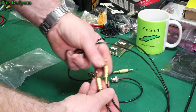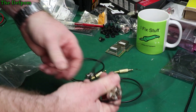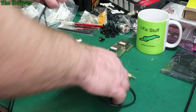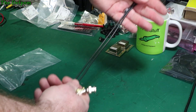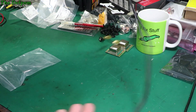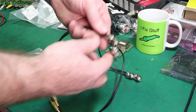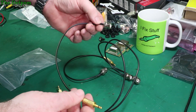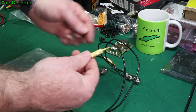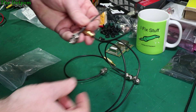So we've got some 3.5mm mono plugs to BNC connectors. The reason I've got these is for hooking up test gear - two different lengths, 30cm and 50cm. I'll plug this into the front of my Marconi 2955 as an audio input, hook it up to a radio into the speaker section, and inject audio through this. That's the plan.